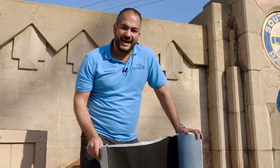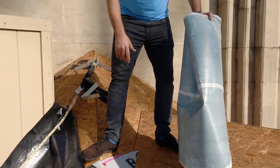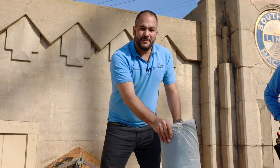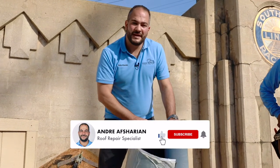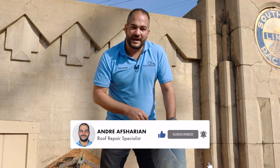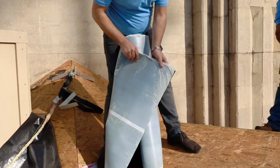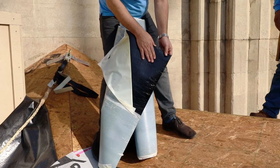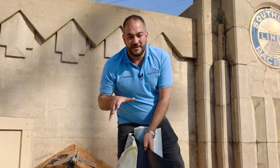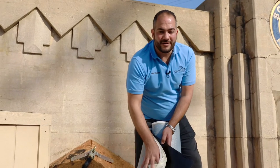In this video I'm going to show you how to install ice and water shield in your valleys. In California we don't install ice and water shield around the eaves — we just install them in our valleys and around penetrations. This is an important step to extend the life of your roof, and as an Owens Corning Platinum contractor, this is one of the things that allows us to provide the platinum warranty to our customers. Ice and water shield is essentially a self-adhered membrane that has an adhesive backing and is also thicker, providing additional defense and waterproofing capability in our valleys, which are one of the most vulnerable areas of a roof.